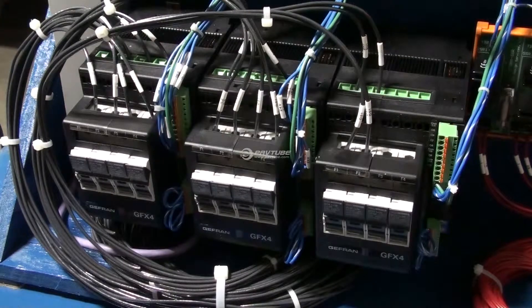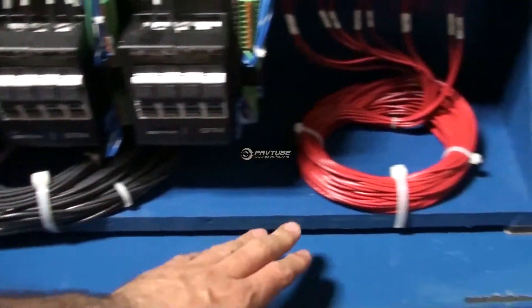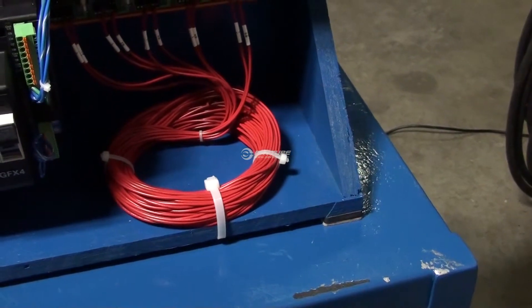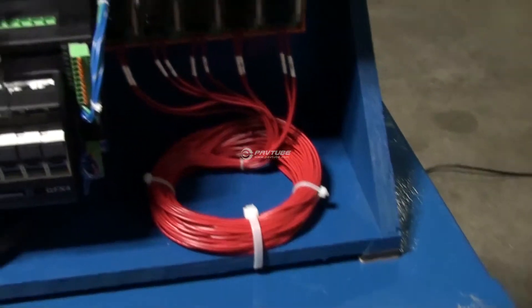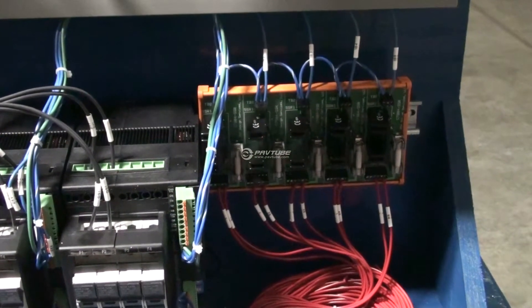It's a relatively simple installation procedure — about 10 steps involved. You remove the old controllers from the operator panel, remove the old heat and cool relays from the panel, then mount our two DIN rail sections — 22 inches wide — onto your panel. Connect your incoming and outgoing heater wires, then connect your incoming and outgoing cooling wires. The cooling solid state relays are fused at 10 amps and the devices are rated for 240 volts.